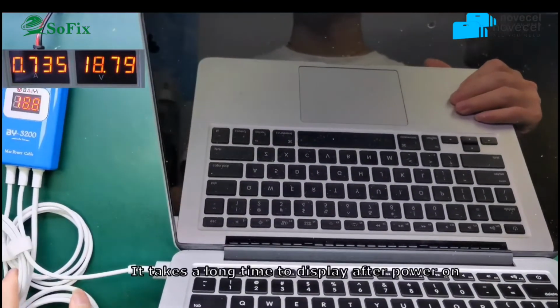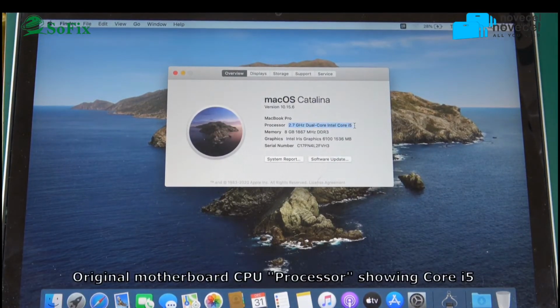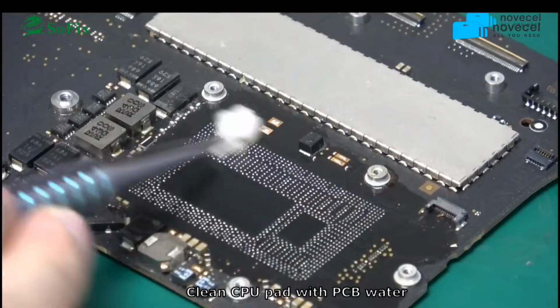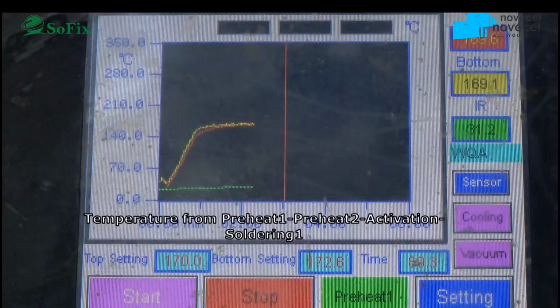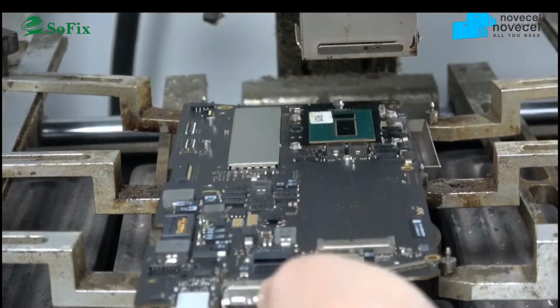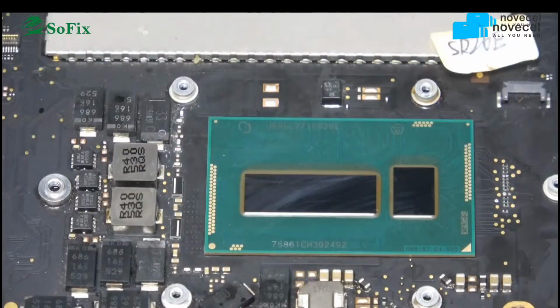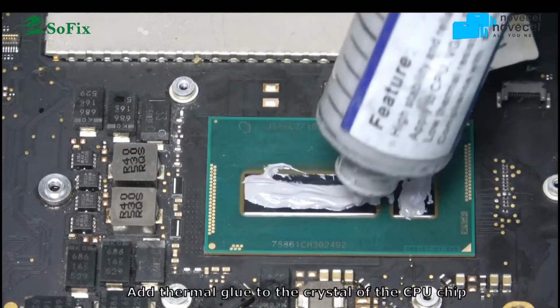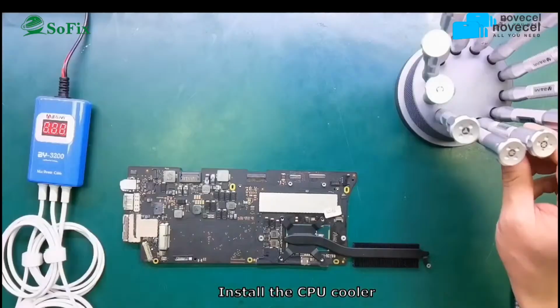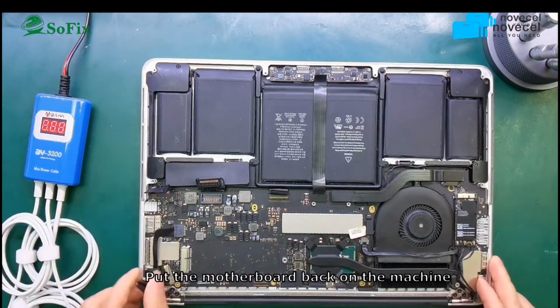Now you connect the power. But you see the current. Now you see the current jumps, but no display. Okay, wait. I connect the power. Then the current is okay. Take it out, then install the motherboard. You can see the current jumps, but no display. Why no display? And the display is very slow.